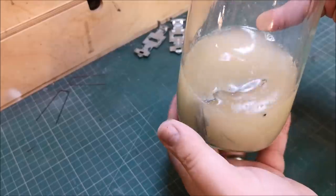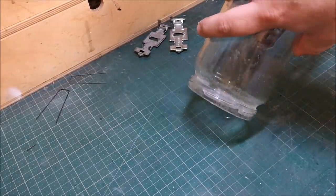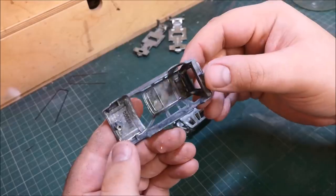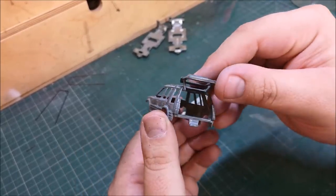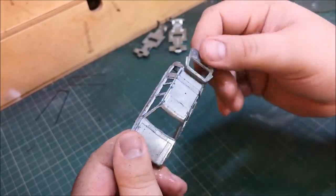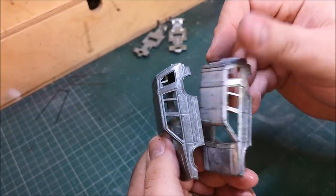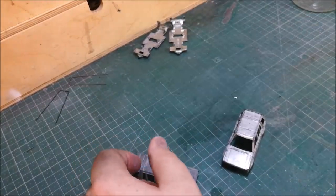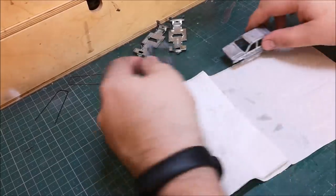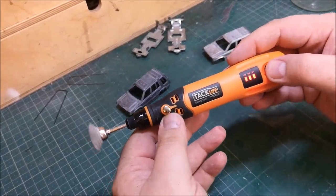It's been perhaps 15 to 20 minutes and the water is still relatively warm to the touch. I think you'll find we have 100% paint removal on this casting, and 100% paint removal on the second casting — so I call that a 200% paint removal today. Look at the differences in the castings — kind of different reactions, perhaps different metals. There were some very minor differences in all of the parts, but they're all interchangeable. We'll start polishing them up now.